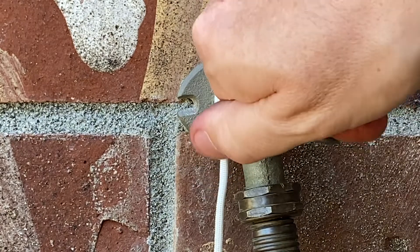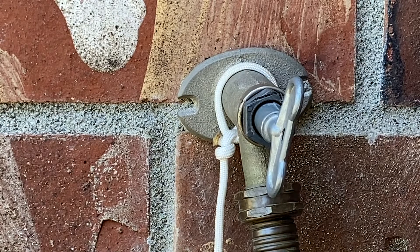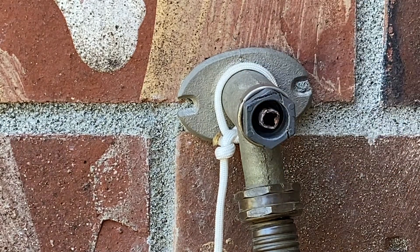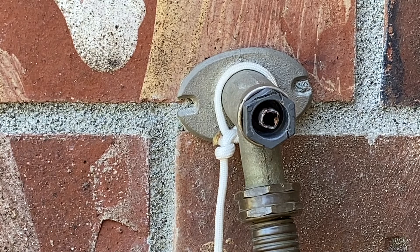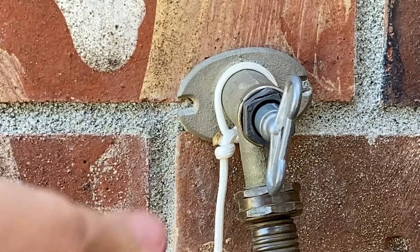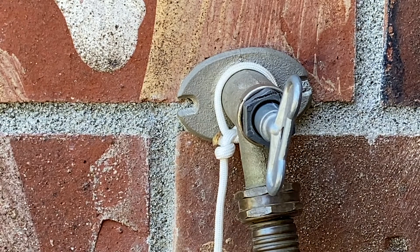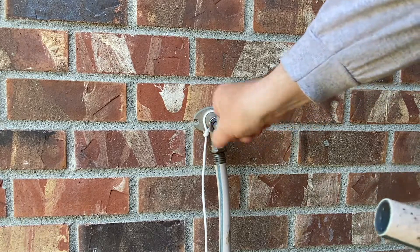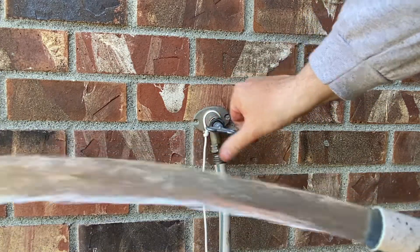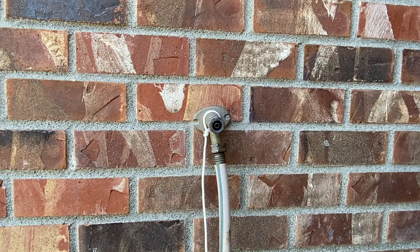I don't feel it leaking. So hopefully it's going to work out really well. I'm just going to crack this open and then go turn the water on. You can hear the water flowing but we've got none coming out right there. That is great — if we just crank this on, you can see I've got water shooting out of there but there's none coming out of the stem anymore. That J-cone washer worked out well for us.